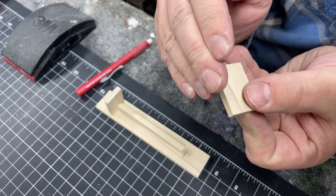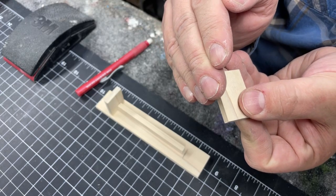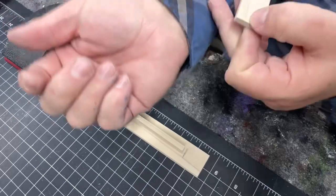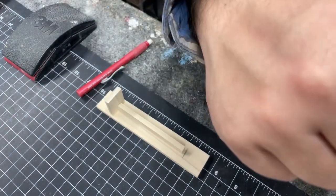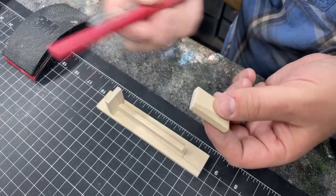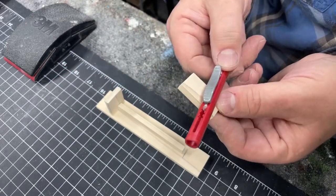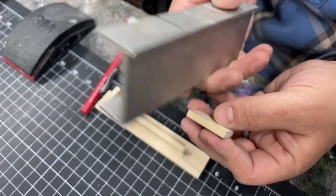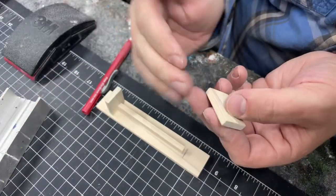And if you have a little bitty micro splinter just sticking out, just poking its little head out, and a piece of fabric like this runs by it, it can catch that splinter and tear out a chunk of wood. Or if you have a tool come at it and it's a sharp edge, a heavy tool hits it, bing, and dings it, it can create a chip and then splinter out.